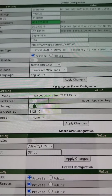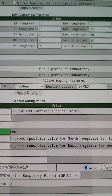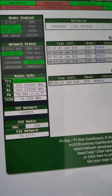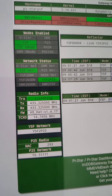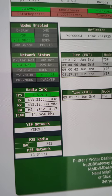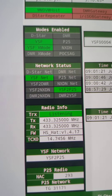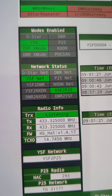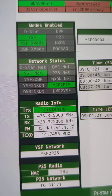I've already got the YSF to P25 connected. You hit apply changes to make sure that's loaded in, and then you go to the admin page. On the admin page, which is where I do my operations from once set up, you can see in the modes enabled section that you have YSF enabled and also YSF cross mode or X mode enabled, and those should both be green.